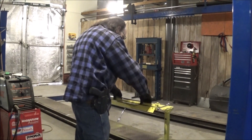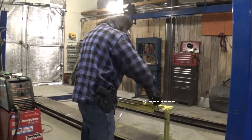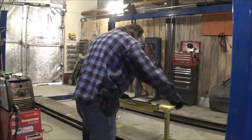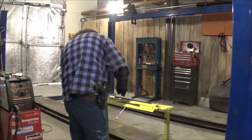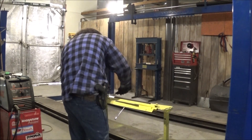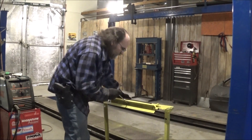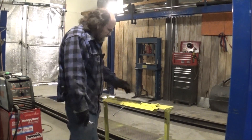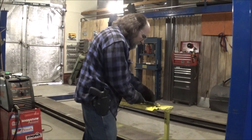So I'm going to try this — just a piece of door trim. It may not even work but it's worth a try. If it does work, it saves us a lot of time and trouble. And then tighten the bend. Would you look at that — putting that piece of rubber trim on there made it where the metal wouldn't slide. And I got a good bend.